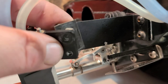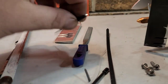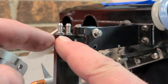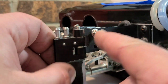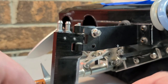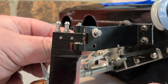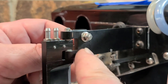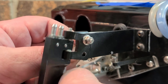Let's get to it. I got the nut off — the rudder is ready to be pulled off the bracket. All you need is a hacksaw and maybe a couple of files, plus of course the tools to take the rudder off. It's a pretty simple, straightforward modification. I got the cooling lines off and my steering linkage off. I put the screw back in the rudder so I can use that screw as my pivot point, and use the bottom screw to actually mark where we're going to be cutting the rudder base.